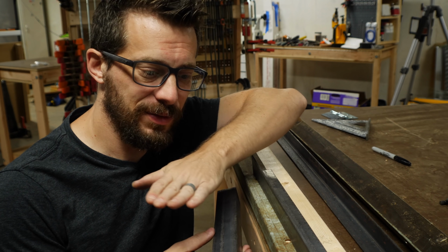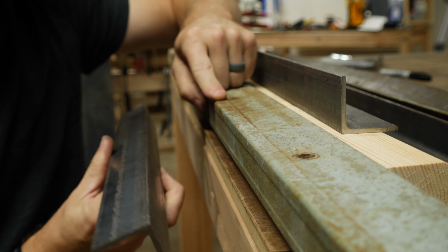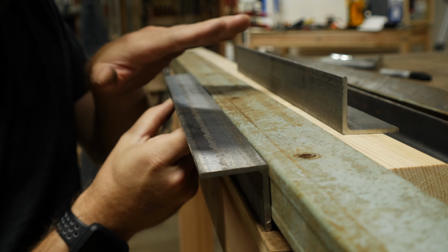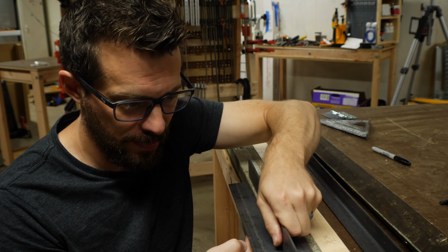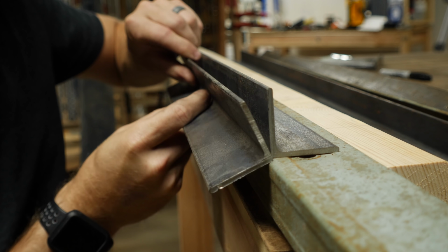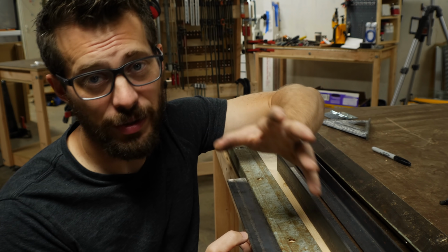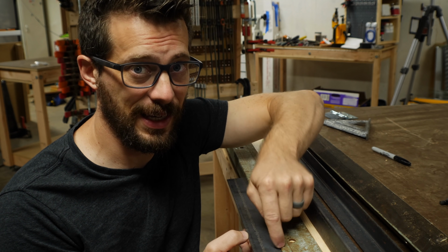To use a metal brake, you have to have a flat surface that can bend and then a point that it bends over. We're going to start with a fixed piece right here, and that's where the metal's going to lay. The pivoting piece goes right up to it and has to be perfectly flat with it so that it can bend. Your sheet metal that you're going to bend lays on top of these two and then is held down with another piece, and this is the point that it's going to bend over. So essentially you have 3 pieces of metal that all kind of join in one corner. Your workpiece is going to go inside, and when you lift this one down here, it's going to fold the piece up. I'm telling you that because it really matters that these 2 pieces are at the same level, and we're going to have to modify some hinges to make that happen.